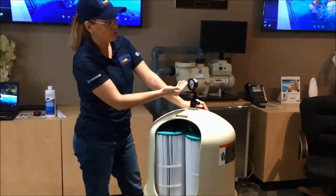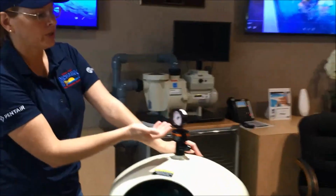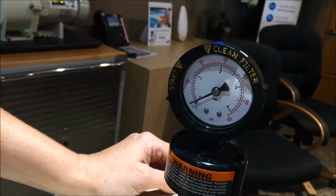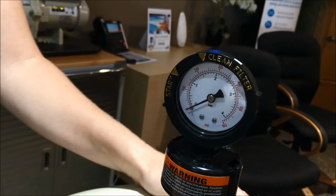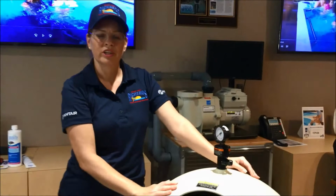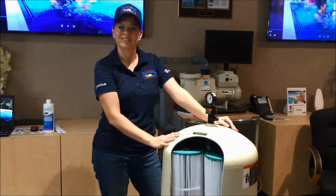Take note that your new starting PSI has improved from before you cleaned it, so you can see that you did a good job. And just keep a watch on that for the next time it needs to be cleaned. And you're all set. Thank you.